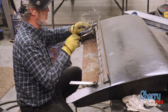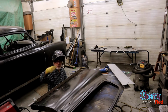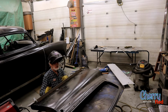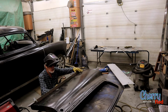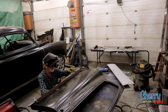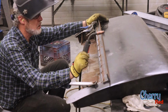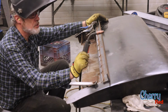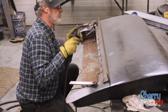I did that for the roof of my 29 Dodge. I actually made 1-inch square tubing hoops that went across the roof. And every one of them had a different curve in it. So I just cut a big block of wood with the sharpest curve in it, which was at the back. I think there were 5 of them, and they got to almost no curve at the front one. So they had to gradually get straighter and straighter. Well, I cut this big block of wood, I think it's 3 inches thick or whatever, and just put it in my press, held the ends down and pressed up in the middle until I got that curve.